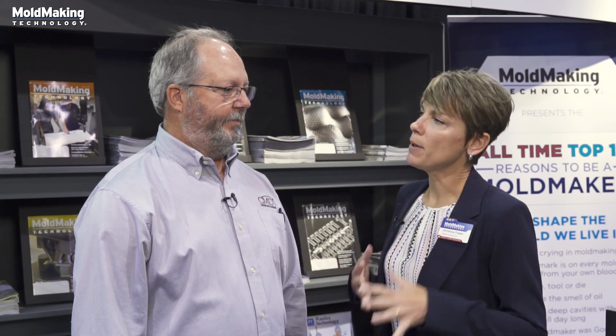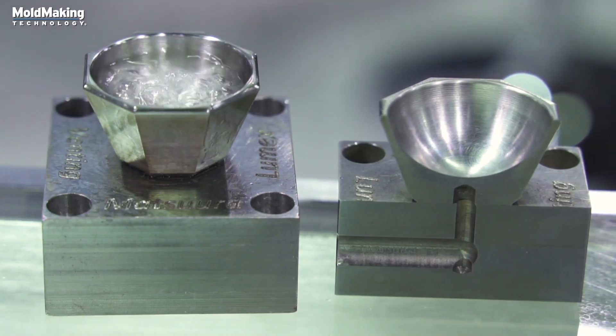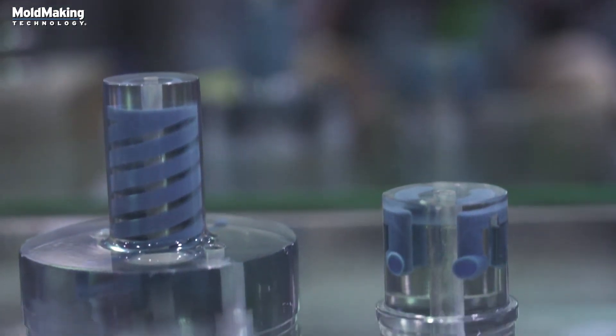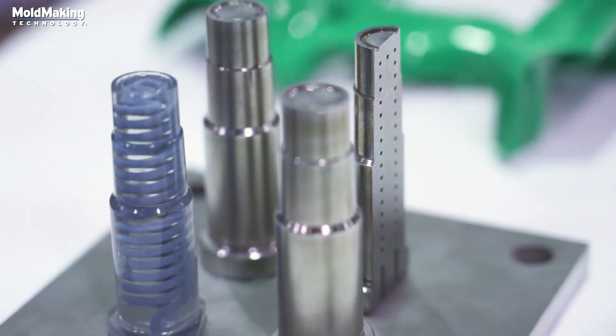So can you talk a little bit about what is the main benefit of conformal cooling inserts made with this hybrid technology to the OEM, to a molder, and to a mold builder? I think it gives us an opportunity as the mold builder to provide solutions to our customers. We're really looking for the opportunity to build the best quality parts for them, and if we can do something to increase their efficiency in their molding processes, that is a really great benefit. That's really the beauty of conformal cooling — we're able to build components that there's no way we could manufacture conventionally. We've got spiraled water channels that we could not machine any conventional way, so we're able to provide that to a customer that needs a complex part. They want to reduce the cycle time. We've got an example where we're able to reduce the cooling time by 44%, which helps them afford the more expensive tool because they're going to save money — potentially hundreds of thousands of dollars — in their production of that product.